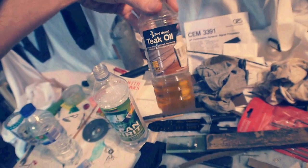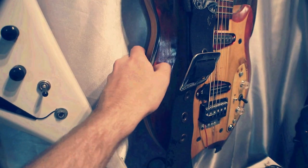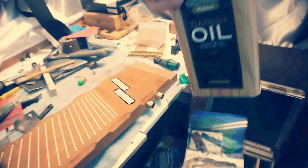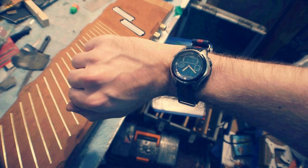Oh, and the oil is just a temporary finish, because eventually I'm going to apply the same finish as on this, except apply it correctly, because I applied this with a brush without sanding it, and it's a bit rough and rubbish. What that is, is refined Danish oil. So yeah, that's going to go on it, but not yet, because it needs 3 coats rubbed on, 6 hours between each coat, and I have 2 hours before I need to set off, so...